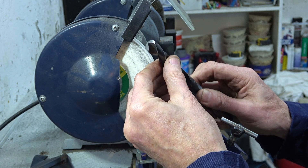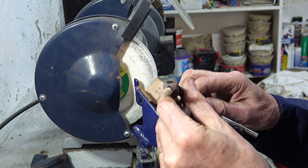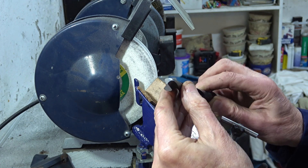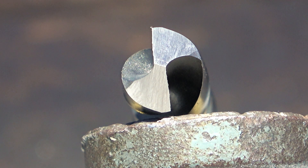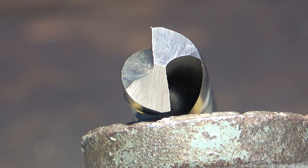I don't know if you can see that. Let me turn the view around so I can see what you're seeing. That's pretty good, I think. I'll do a proper close-up. My drill jig only swivels in one plane. To cut a drill perfectly, I'm sure you have to be able to twist and turn at the same time, so that cut is an approximation. But you can see it's nice and bright. Believe me, it does have a back-off angle of about seven degrees, and you can see that 45-degree chisel.